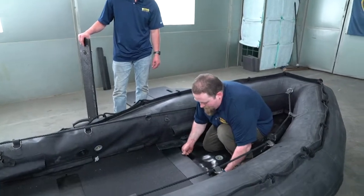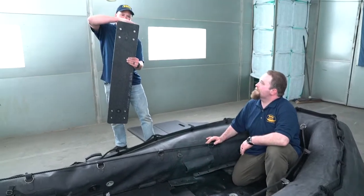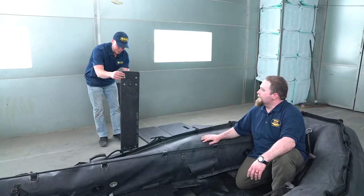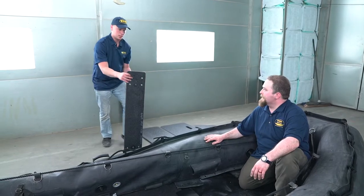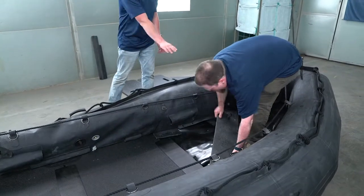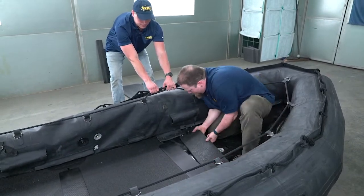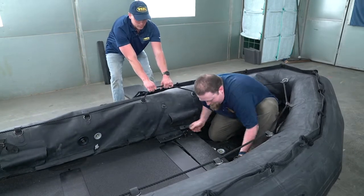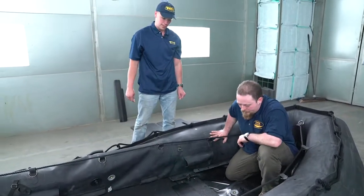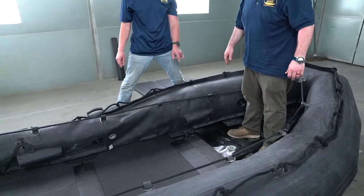Next process: last wide joiner — secure it all the way. Your thrust board is tapered because the tube starts to taper as you get towards the bow. If you don't know which side is which, set it on a flat surface and see which side it leans toward — that side goes towards the bow. Start with a wedge underneath one side. The tube is flat so the material should fold, making it a very simple install. Rocking the tube can help as well. Make sure your spacing is tight, then go ahead and bolt down the thrust board.